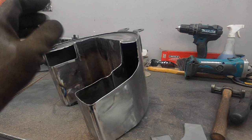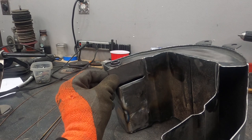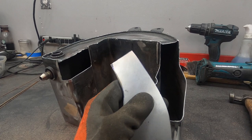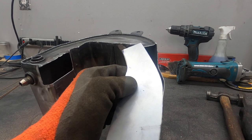It's welding time. I want to match the original pinch — this piece will come in, match the top pinch, then I'll do a small plate on the bottom section here to fill the gap. This piece is going to need to be bent, so I'll put a temporary tweak on it. The great thing about working with 18-gauge is it's so thin you can manipulate it however you want. I'll tack the back on and then gently work my way all the way down — most of the time you can just bend this with your hand and tweak it exactly how you want.